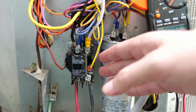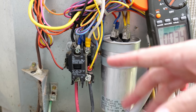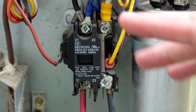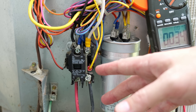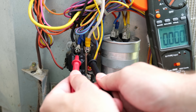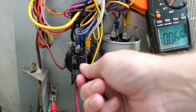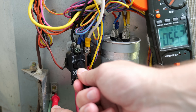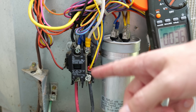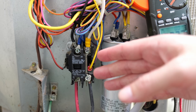That's the number one test I would do to check if a contactor is bad, but here's another one. I've pulled the disconnect on my AC unit so it's not running, but the plunger on the contactor is still being pulled in because the thermostat is still calling for air. This is simulating a bad contactor — the plunger is pulled down and contacts are made, but if we check the top terminals, we don't have 240 volts. Testing the top left leg to ground gives essentially zero voltage. If the thermostat is calling for air, pulling in that plunger and making contact, there should be power going to the top to start up the AC unit.